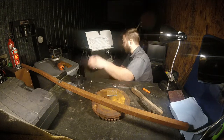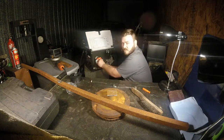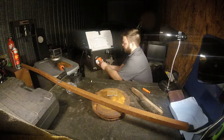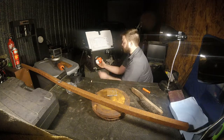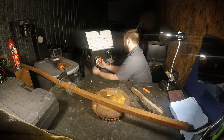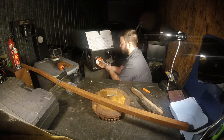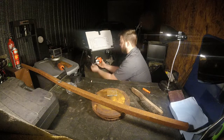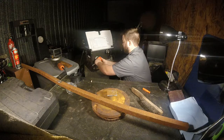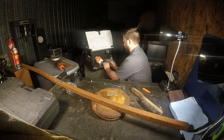Yeah, I'm already pushing my limit here, about to make a bird's nest. Because if this wire slips out from under my finger, it's all over with. Ideally you want to have the spring pushing against the spool before you even start undoing your wire. Because if I was to clamp it down in the feed roller right now, the wire would still find a way to unravel and spin the roll around. It's probably too tight, but it'll work for right this second.